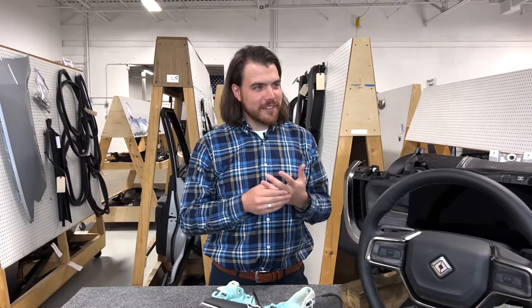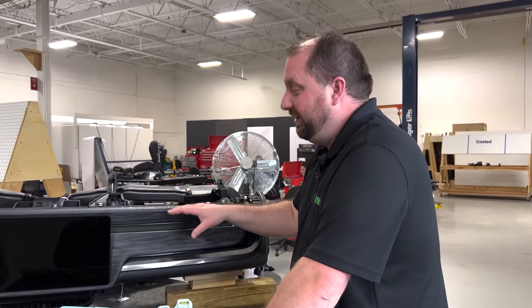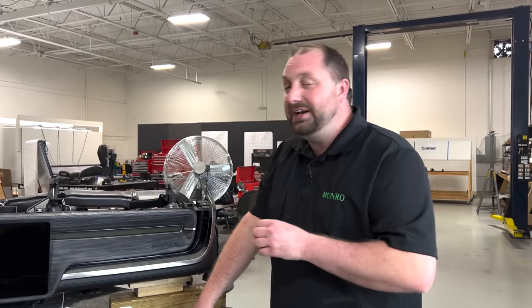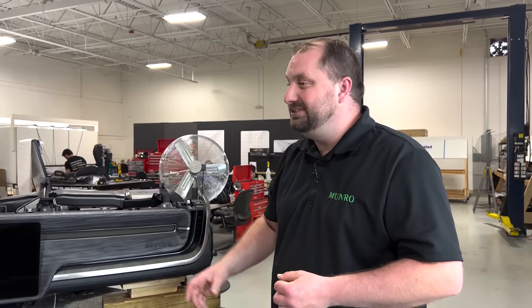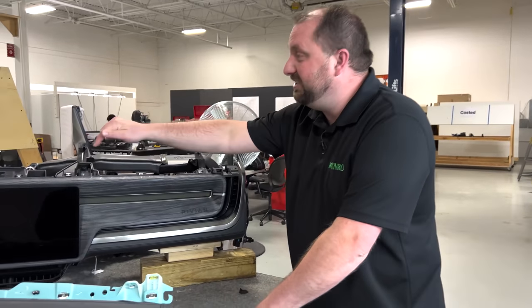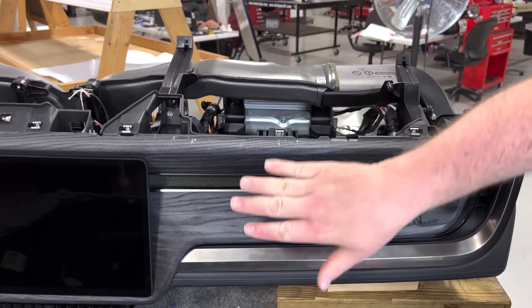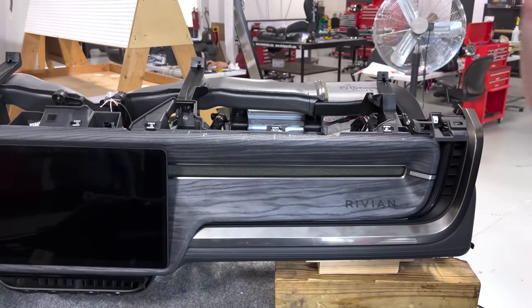You've got this little kind of bird's beak cut, and not only does it have to be precision cut, but someone has to manually put that into the tool, fit it, hold it so the tool can close and then shoot behind it. The tooling will hold it in place once they figure it out - that's why when you build a tool you have to be very specific. There are many different resins you can put into an injection mold: ABS, polypropylene, nylon. You have to build your tool specific to the resin because every resin has its own shrink rate. If you're injection-molding something as polypropylene and switch to ABS, it's going to shrink differently, meaning all attachment positions will be in a slightly different position.